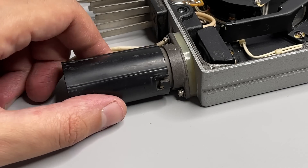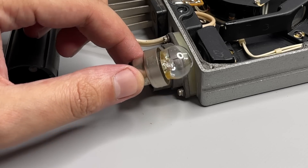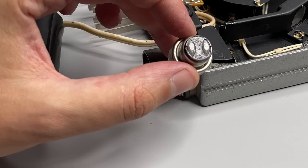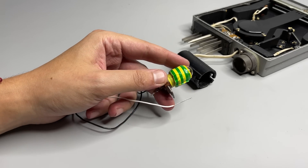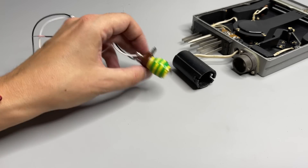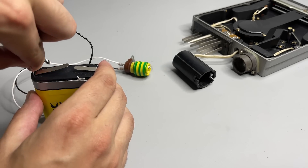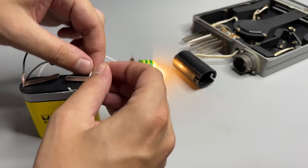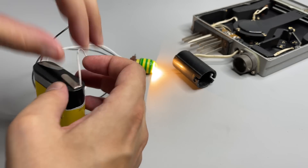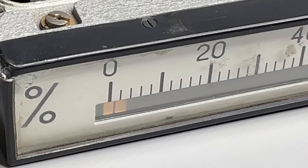For now let's try to activate the device. It appeared that the light bulb is non-functional — it is a little bit special, with 3W power, and a ring around it that positions it exactly in the center. I made a makeshift solution using a less powerful light bulb powered by a 4.5V battery. Once we install the lamp, we can see the mark. It should be much much brighter, of course — something like this.